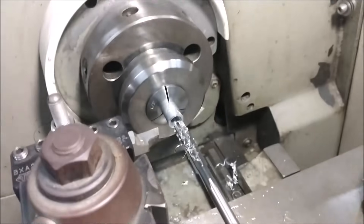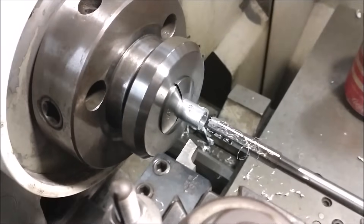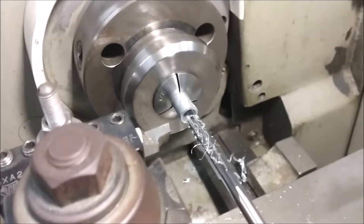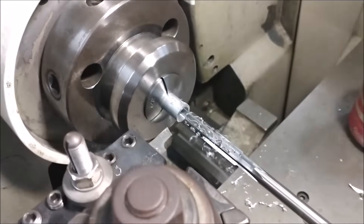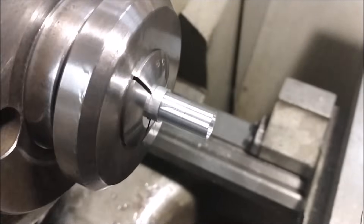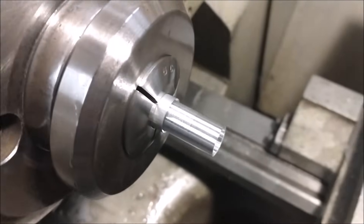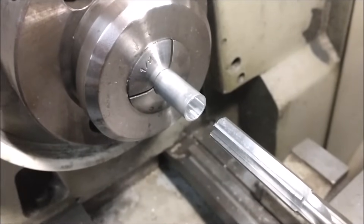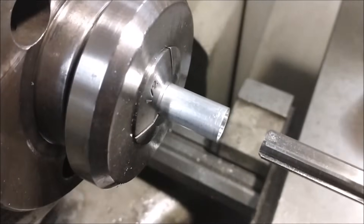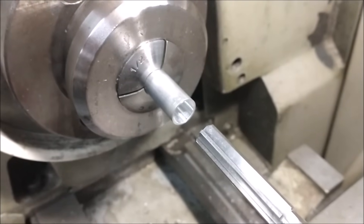Prior to pulling the material off the shelf, the identical material — half inch diameter 6061 aluminum — was chopped into small random lengths and pockets were drilled and reamed in the end of three of the segments at different depths. The bar ends containing the female receiver features were then turned to accept caps. Mating caps were then fabricated out of the exact same OD material, 6061 aluminum half inch, drilled and reamed for a press fit over the end that was just prepared on the other part.